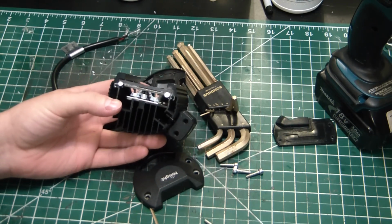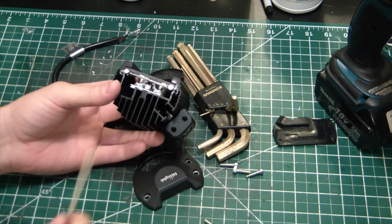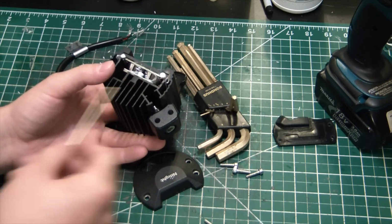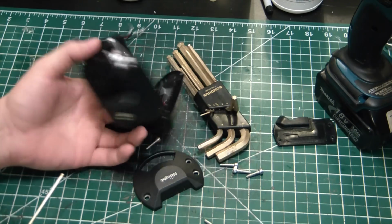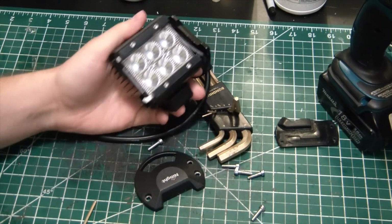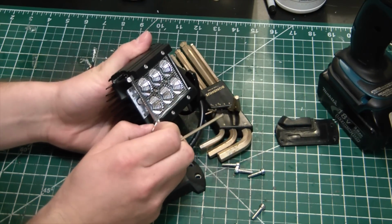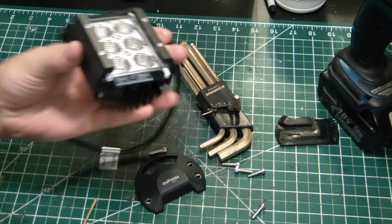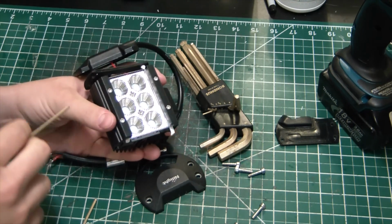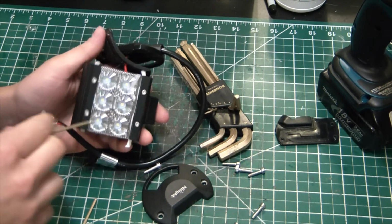Oh, now here I am impressed. So they actually have the board mounted to the aluminum. So these things are really actively cooling. Well, I mean, it's not an active cooling system, it's passive because there's no forced air. But when you're moving, the turbulence would actually kind of create an active cooling system. So looking here on the front side of things, they actually have this, it's a silicone of some sort, and they have that sandwiched between the plastic and the gasket. So they're actually doing a good job of stopping the ingress of water here. I mean, this will do it, in my opinion.